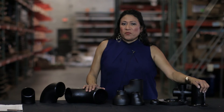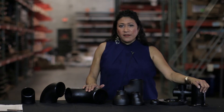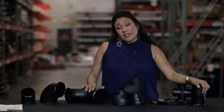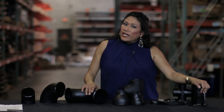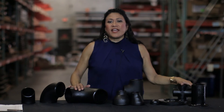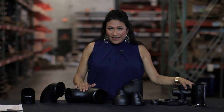In carbon steel you will often see A234 WPB. The body is seamless in sizes up to 24 inch. In carbon you will also encounter high yield material, which is MSS SP75 with WPHY42, Y52, Y60, Y65, and Y80.